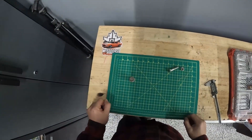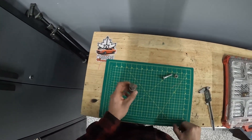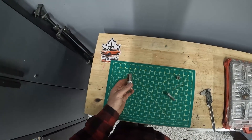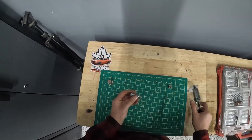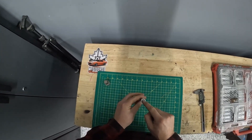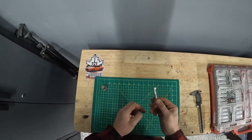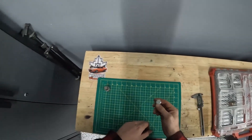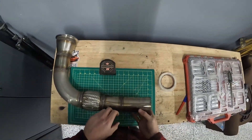Allen keys — say you don't have a big allen key, like a 17mm. A lot of people don't own this and you'll probably use it about five times in your life. One thing you can do is grab a bolt with a 17mm head, take a nut, and just weld it around there. Now you can put a wrench on here and this end will act as your 17mm allen key. I used this for a few years when I owned a Volkswagen and needed to drain the transmission fluid — that trick works really well.